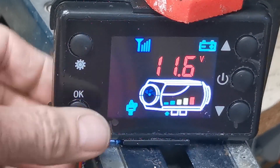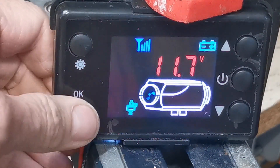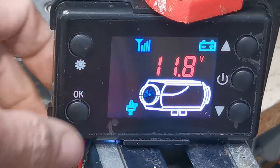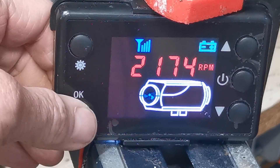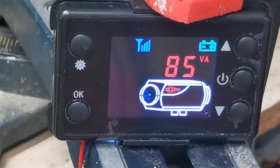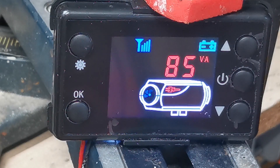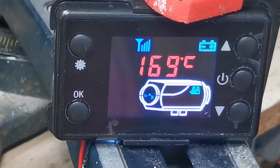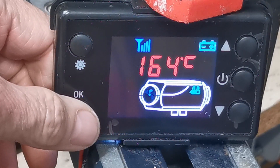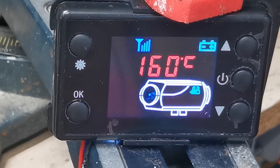I'm doing a shutdown now — you can hear the beast roaring away behind me. It's quite simply press and hold the start button. Now it starts shutting down. Scrolling through the screens: you can see the pump flicking away. You can't actually scroll until the pump goes off. Now scrolling through — no power on the glow plug yet... now it's kicked in. On this one it cuts the fuel, then fires the glow plug straight to 85 watts, whereas on startup it ramps up slowly. You can see the case temperature starting to drop.